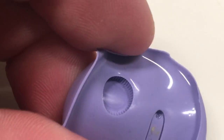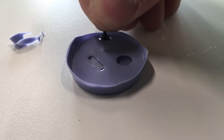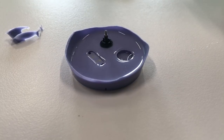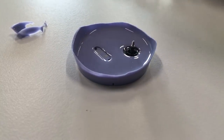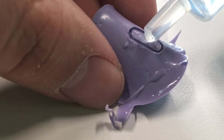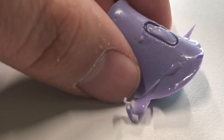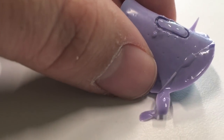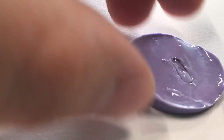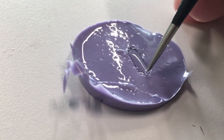I've taken a molding of the crown here. You can see how flexible this mold material is. I'm going to show you how I pour that. Carefully take some of the liquid epoxy and we'll fill that up and center the screw in there. I'm going to do the same thing with the power button. It's a bit of nooks and crannies on this, so I'm going to take my tweezers and gently push the epoxy into all of those spaces to eliminate any air bubbles.